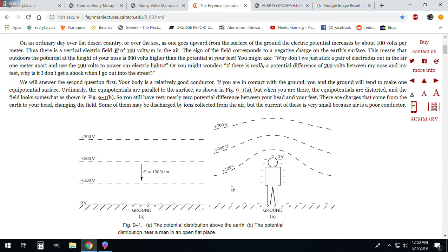So there's almost no current, right? If you were to calculate, say you're reaching 200 volts and you're getting the full 10 picoamps, and you want to know how many watts that is, how much power can be done with that, well, you multiply volts by amps. So if you multiply 10 picoamps by 200 volts, you'll get, I don't know exactly, but it's less than a microwatt. It's not enough to do any work at all.